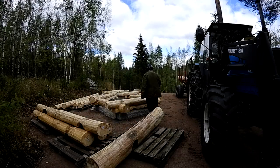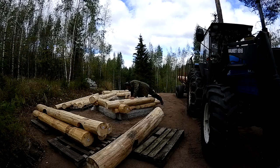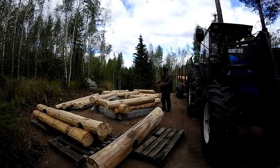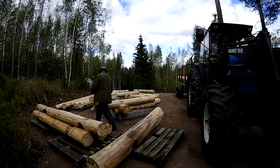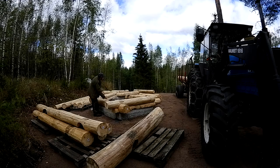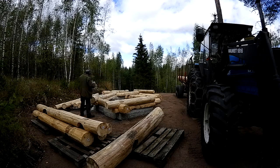What I'm going to do now, before I take these logs off, is I'm actually going to draw that whole horizontal groove line. And the reason for that, did my pencil just break? Nope. Is that once I get the threaded rod down into those holes with some glue, then I'm going to have to, for instance here, carve a little piece of wood away from the top of here so that the bolt and the washer sit below the surface here. And when I've got two lines on there, I can see the area that's covered where that's not going to show. I should have done it on these two logs as well, but I forgot. But at least I've remembered for these ones.